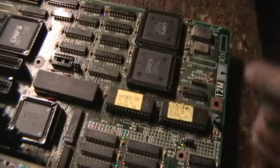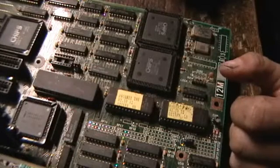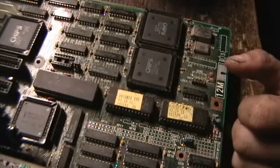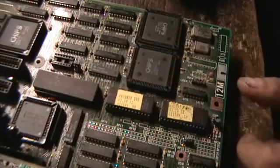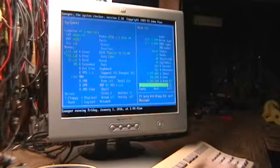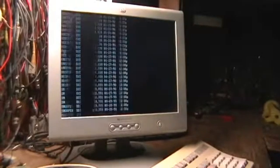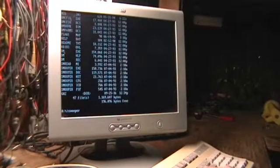That's what I did with this motherboard here. It was getting to the point that it was flaky when it would heat up — it would randomly crash, or refuse to boot. I pulled the EPROMs off and read them at low voltage to get a solid reliable copy of the BIOS. Then I re-burned them verbatim to the chips, put it back on, and as you can see now it's been running about 20 minutes and not a single glitch. I've tried restarting it and everything else, and pretty much no problems at all that I can detect.